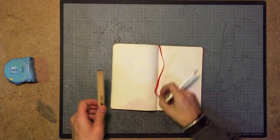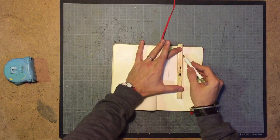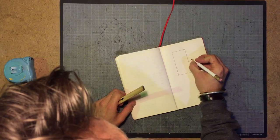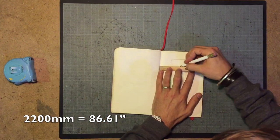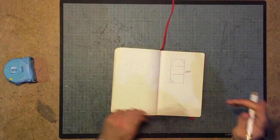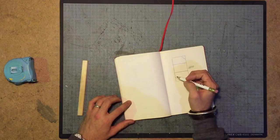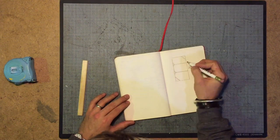So let's go. Okay, so the quickest way I know how to do it is we've got our two uprights like so, cross pieces like so. For this flat, we're building it 2 meters 20 high, so we're going to have probably two cross pieces, 45 braces like that, and then instead of having mortise and tenon joints and shoes going across here, I'm just going to cut some 3mm ply and stick them across here.